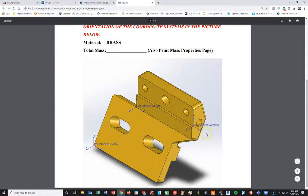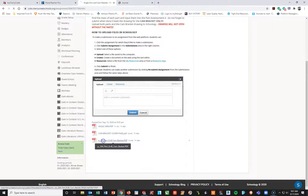My approach on this one is I'm going to start from the right side view. I'm going to create a rough outline, get it all dialed in and dimensioned, then extrude it across. From there I'm going to cut away - I can get quite a bit cut off in one step. I'm going to cut off this corner, this angle, and these two holes, then punch a hole through the back part, punch a hole on the side, and use the hole wizard to add the last two holes. I'll then put my coordinate systems on and finish with the feature fillets.